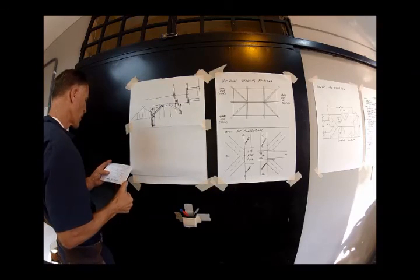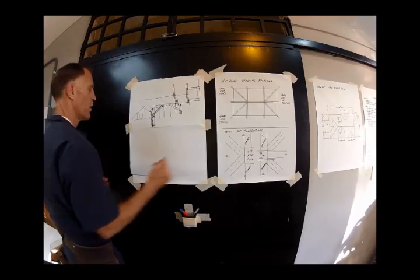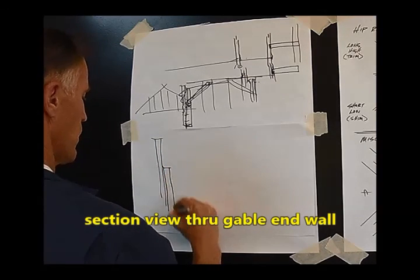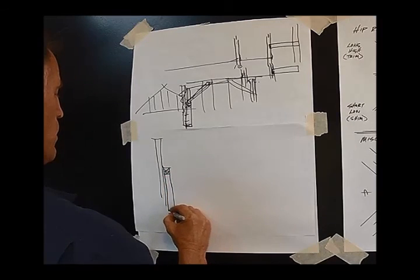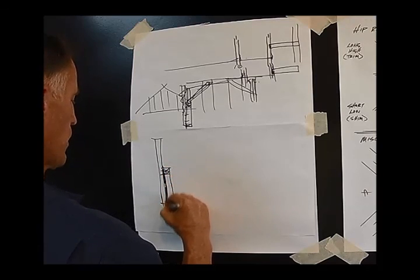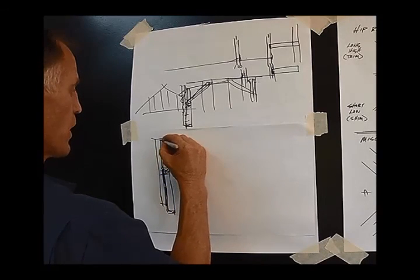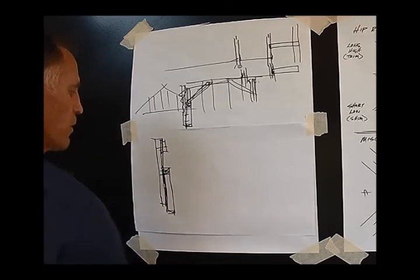A question also brought up how to use your sway stick when you have a shear panel on the outside. Simply put the sway stick up against your shear panel. This is my outside wall — we're tacked to the shear panel right here. Just take a little time to tack it up top, so now you'll be flush there, and when you stand up those first rafters, this is your helper — it'll be at a great height.